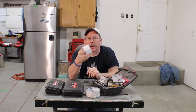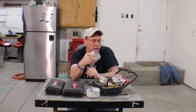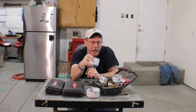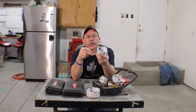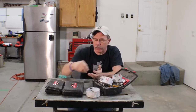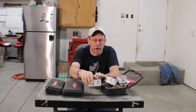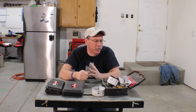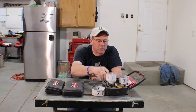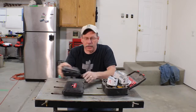For example, this is a 3-1/8 inch hole saw — I guarantee if we cut a hole we're going to end up with something closer to 3-1/4 inch. If you plan ahead for that, it can work, especially if you're just getting the hole roughed in and then you're going to grind it out some more by hand. Hole saws have a great purpose if you use them for the right job, but high precision is not one of them.